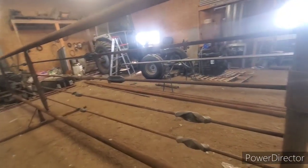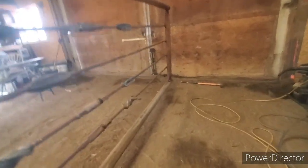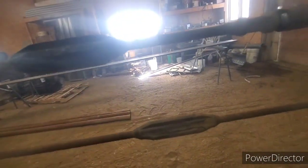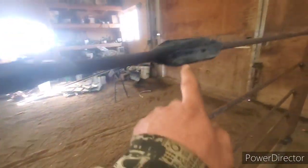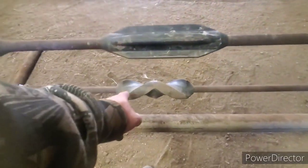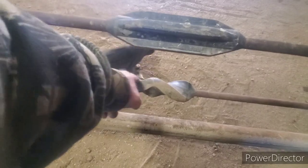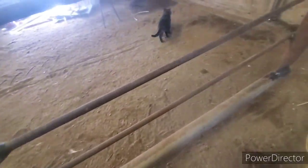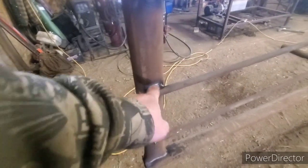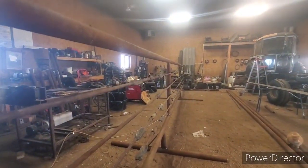I brought the sucker rod around. It would have gone a little bit quicker if I didn't have these scrapers, because I had a couple that lined right up where I welded it to the pipe. So I had to cut them and slide them down, or I cut them right off. These ones here you can cut off easy, but those twirly-gig ones are kind of a pain. I just cut a strip down here and pounded it off, then cut it off with the grinder.